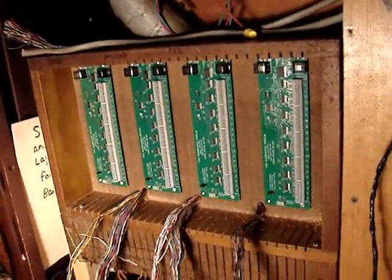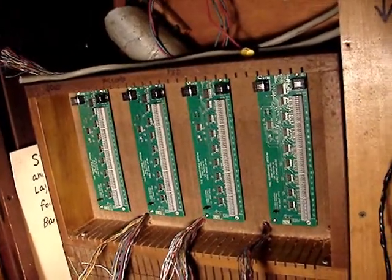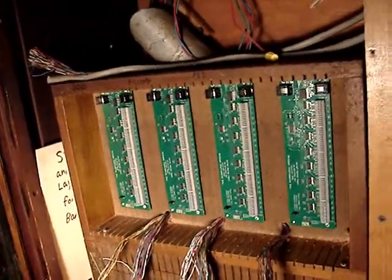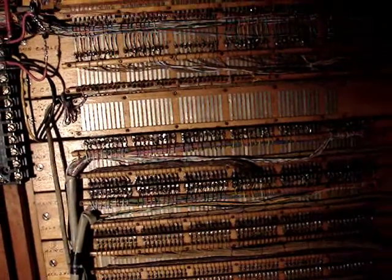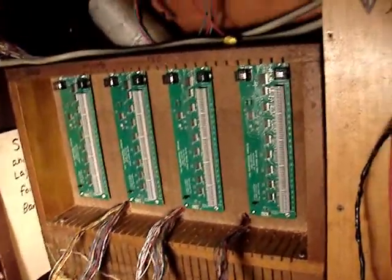And how I'm going to do that is I brought with me a diagram that lists the 25 pair cable color sequence, and I'll just read that backwards. Now there is the possibility that the person who wired these up, I think I found one or two or three mistakes. I'm not sure where they were. I should have written it down actually. But the pair might be reversed.